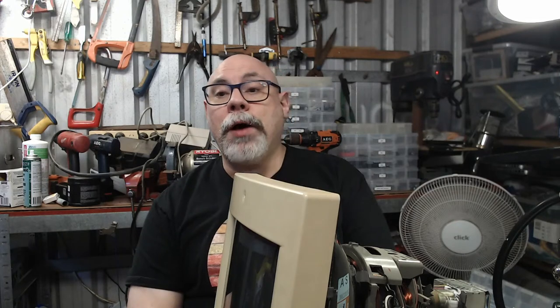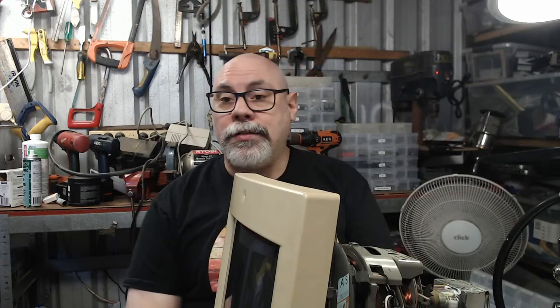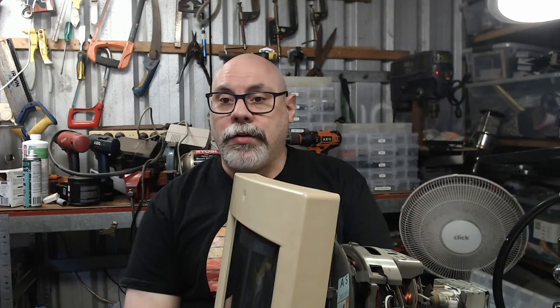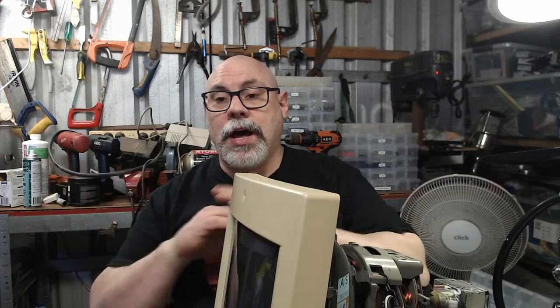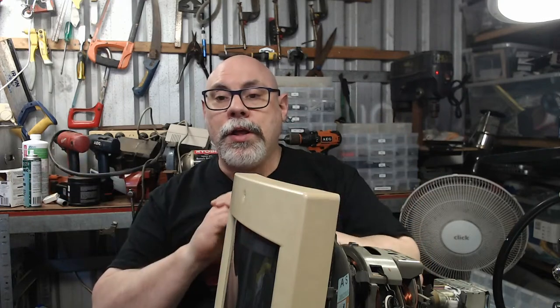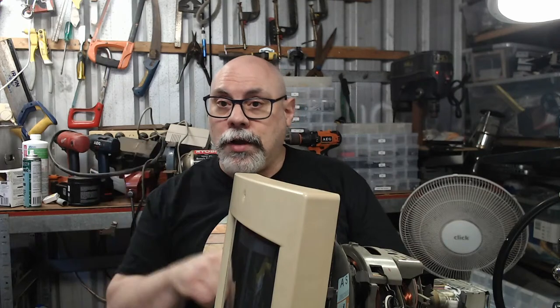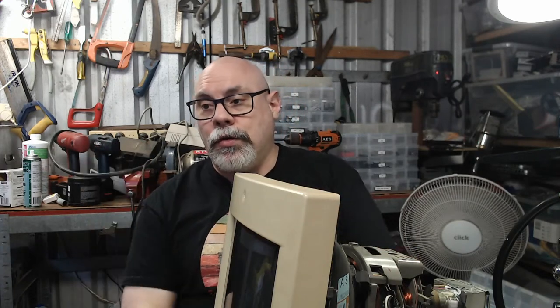So it costs a little bit more to buy them from me, but when I sell them, they're ready to go into the computer. So if you say to me, I've got a Color Classic, I want to put it in one of these, I want System 7.1 on it, and chuck on a couple of games or something like that, I will generally do that. I will get an SD card, format it, put all the software in it, I'll put some little mounting blocks on it and everything like that, so you can then just come in, screw it into your Color Classic, plug it in, switch it on, and you're away.